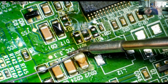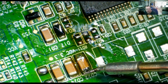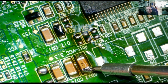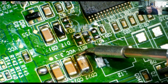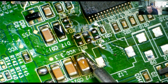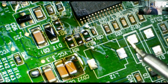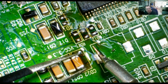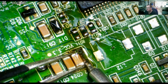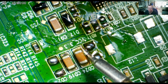Let's try it. So again, we'll come in with some leaded solder. Leaded solder. Let's see if we can actually get it from one end. But the other iron couldn't do this either, and to be quite honest, it's not the way I would normally remove capacitors. I would have to go this way. Okay. Yeah, so we did get it. I have to use the tweezers to move it. Just try it again. I miss my stereo vision when I'm trying to do it this way. Okay, but I've got it. I have to say, I don't think this works as well as the little C115 did.